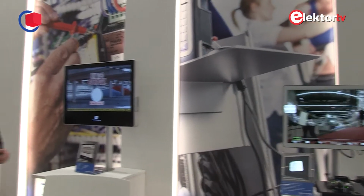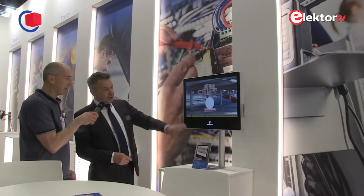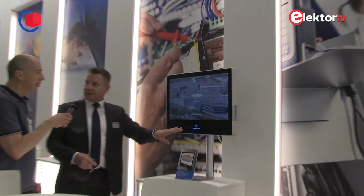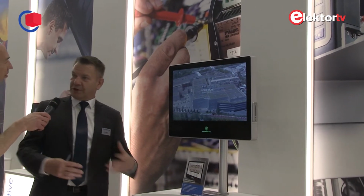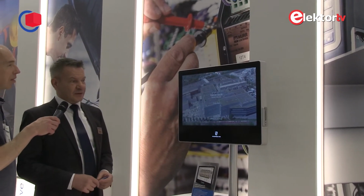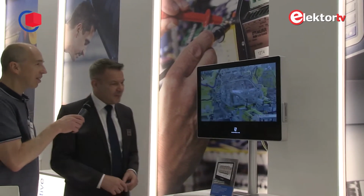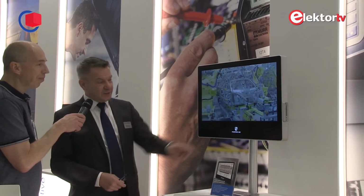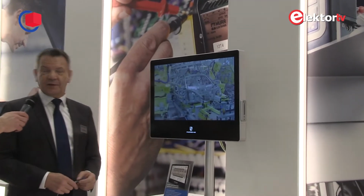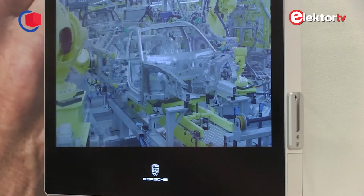It's a 24-inch PCAP sensor, film-based in this case, behind printed glass. By the way, the glass printing is in our factory in Endingen in Germany. We have a fully automated production line where the glass doesn't need to be touched during production. The specialty here is a logo design which is illuminatable. That means you can see the status of the machine, and each worker sees from a far distance the status of the application.